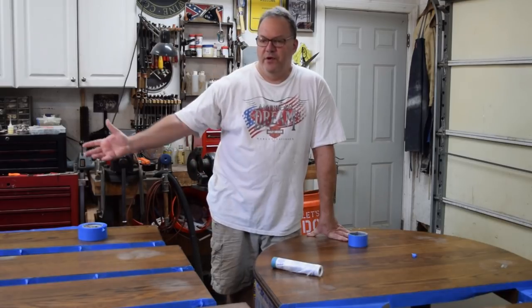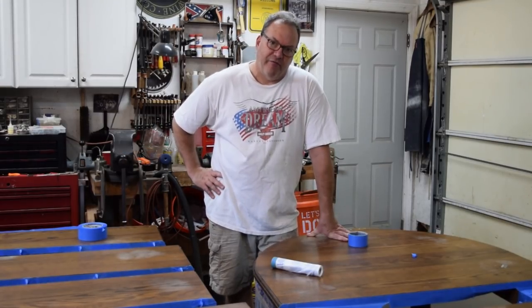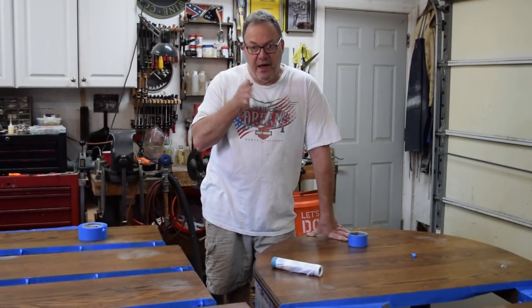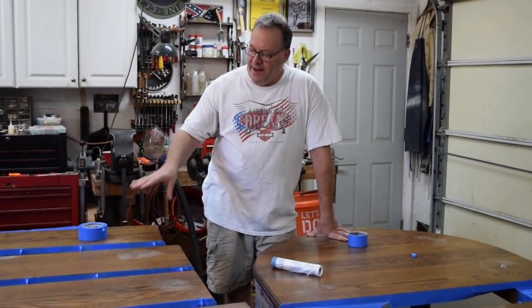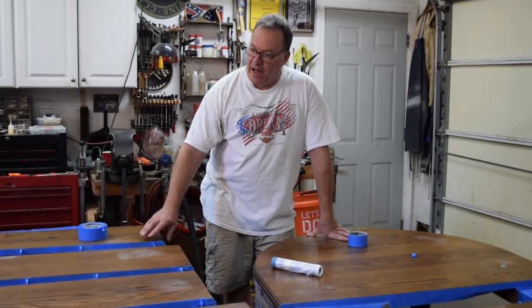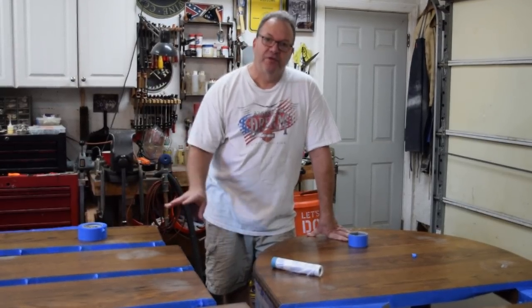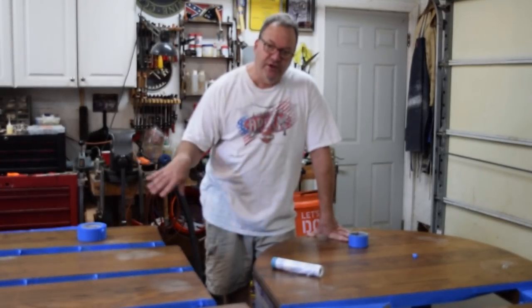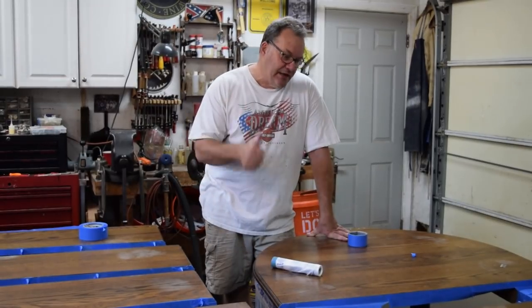We went through, we assessed the project, we identified where the damage is, where we believe that the new finish could best start and stop. We identified what we believe to be a vulnerability with the plastic alignment pins. We came up with a strategy so that we're not going to adversely affect those when we strip this piece. We're ready to strip it now.